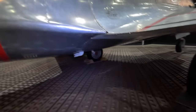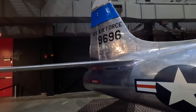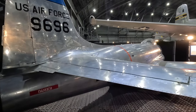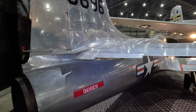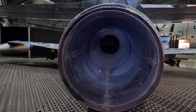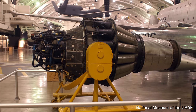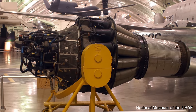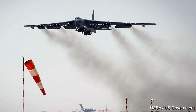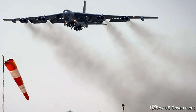Let's move back and have a look at the tail, which was a pretty standard layout, so let's talk about the engine, which was more interesting. It was originally planned to use a British Halford H-1B Goblin turbojet, as the Brits were further advanced with jet engines. Lockheed didn't even have these engines when development started, as only two existed anywhere in the world. The first was destroyed during testing, so de Havilland shipped the one remaining example to the USA rather than putting it into their own Vampire prototype as planned. The second prototype used a General Electric I-40 turbojet, later assembled by Allison as the J-33, producing 4,600 pounds of thrust, or 5,400 with water injection. Water injection, as sometimes seen on display with B-52s, works by increasing the mass being accelerated out of the engine, increasing thrust, and also serves to cool the turbines.